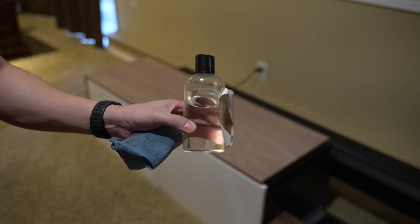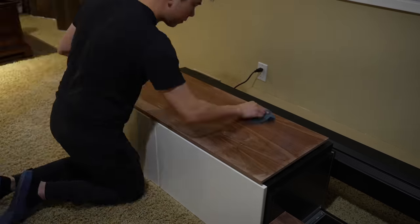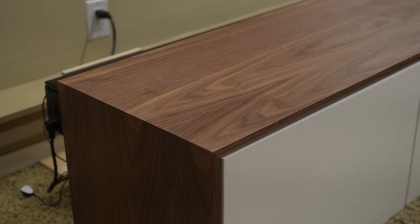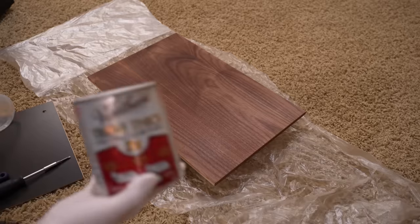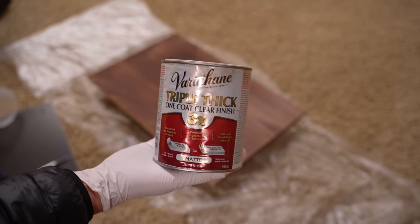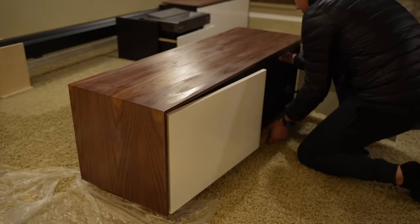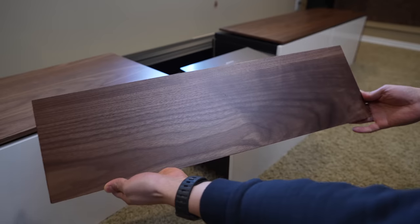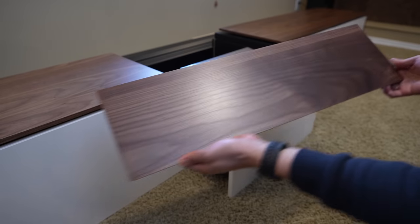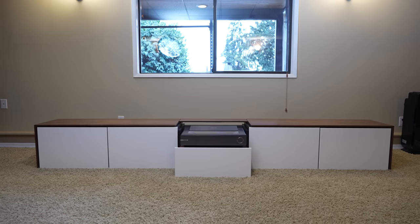To make it look even better, we hydrated the wood with some mineral oil. With any unfinished wood, the wood is usually dry, so doing this really brings the wood back to life and adds more color — it's a night and day difference. Finally, I added two layers of polyurethane to seal the wood, lock in the color, and add surface protection. To complete the cabinet, I made two extra pieces: one to hold the projector on top, and another in the middle so all the units visually connect together — also a great place to hold a sound bar.